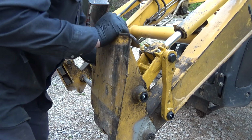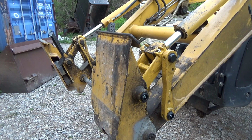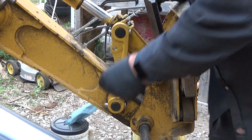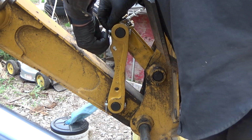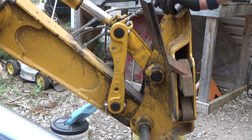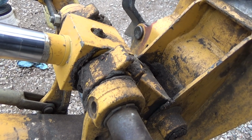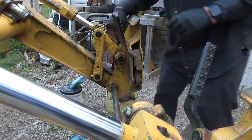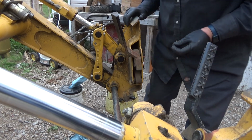So we need, it's got a pin, we got our snap rings in, we got to put cotter pins now in these. I got some different ones of them. That'll work. That'll work. And I'm just going to bend the one ear around. It should be good. I've still got a bit of play in this joint here, but still way better than all this mess here. Yes. So it was down in this bigger bracket thing here, and this pin that was really bad, but this one's not bad now, actually. Oh, we need another cotter pin for the bottom one here.